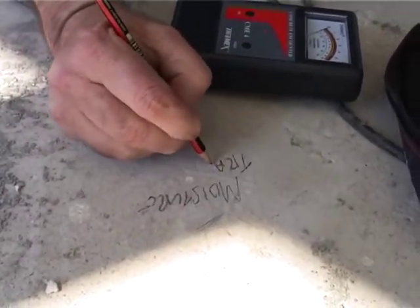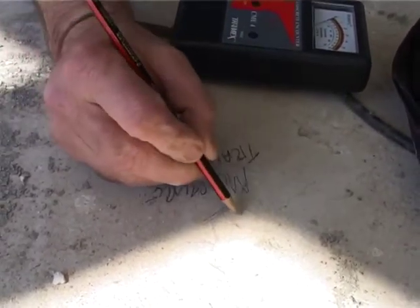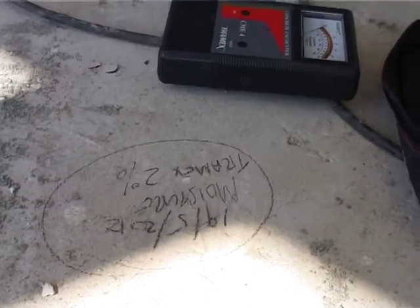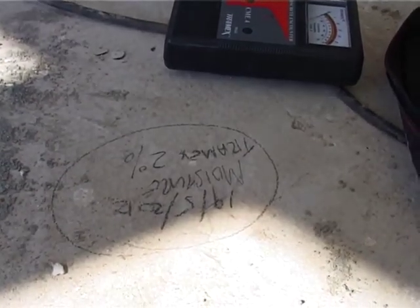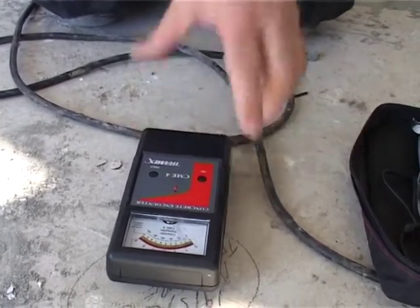Tramex, that's the type of meter you used. 2%. And today's date is the 19th of May, 2012. If there's ever a problem, you'll be able to prove that you took the moisture reading because you've got it here. And not only that, take a camera and actually photograph yourself and your reading, so you've got some proof. Also note it on your quote that you tested the moisture, because if something happens that's not beyond your control and you have not got a moisture reading, it could bite you back, because everything goes back to the